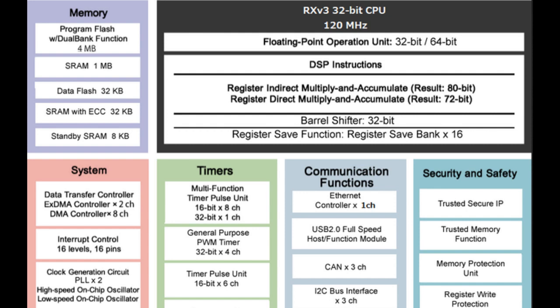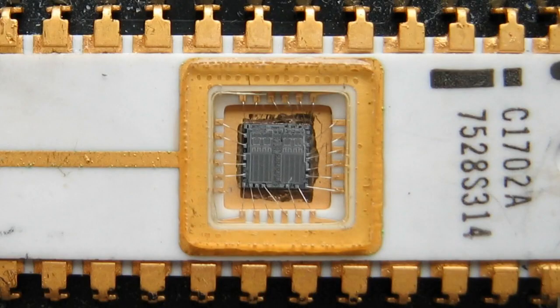Historically, this is what chips used to look like. They'd have flash memory inside and SRAM, though they wouldn't have very much SRAM. The thing about SRAM is you can write and read it basically in one or two instructions — nearly instant. It's very optimized. You usually have a couple kilobytes, but it's super speedy and you can read and write any location you want at any time.